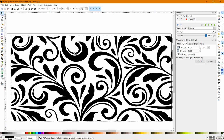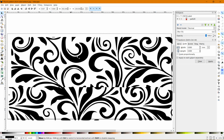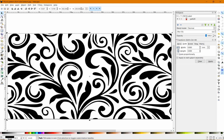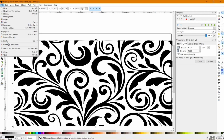So one other thing you can do in this is, by default, if we save it with this right in the center of that outline box, when I import it into Fusion, my grab handle is going to be right in this upper corner. And that means that all those little icons are right where I need to be to see where that corner fits. So I normally save it down around here. And I say File and Save. Now if you save it too far away, if you move this too far away, then your grab handle's way off the screen. So just move it a little bit.